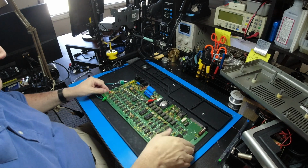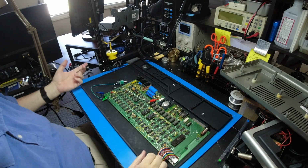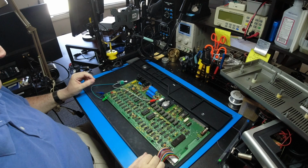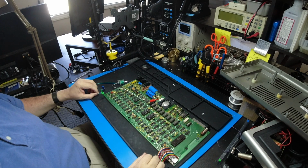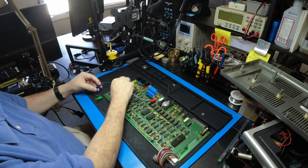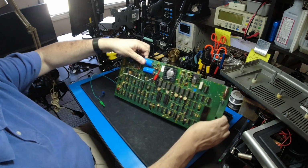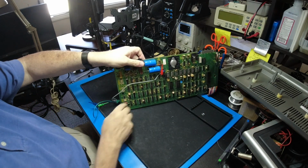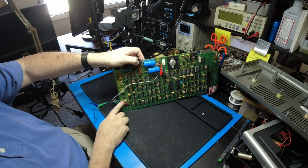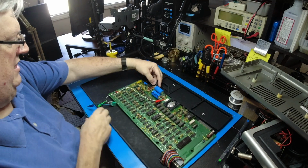Now for the signal, you need a ground and you need the audio positive from the cassette port, which is on this side over here, because of course we're upside down. Where I've traced back through the schematic and with use of a multimeter, you want to connect the positive for the input to R53, which is right down in here. It's 52, 53, 54, 55, 56. You're going to connect it to the outboard side of R53, so the side closest to the edge.